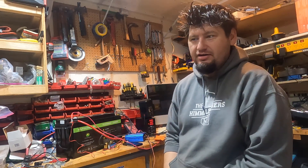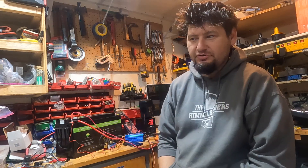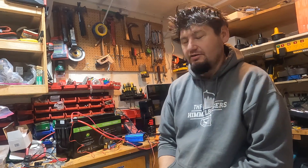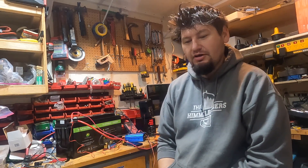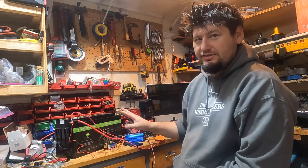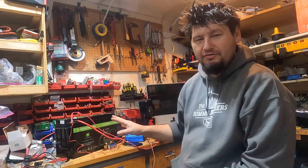I've just tested the low temperature protection on one of the smaller batteries because I can put that in my freezer. My freezer is set to zero degrees Fahrenheit and I tried to charge it and it would not take a charge. So really thrilled with that. But we need to do a capacity test, so let's get started and I'm going to show you what I have set up here.